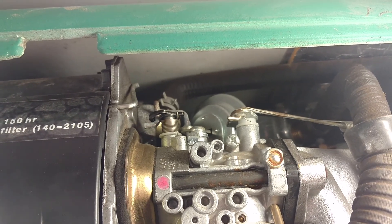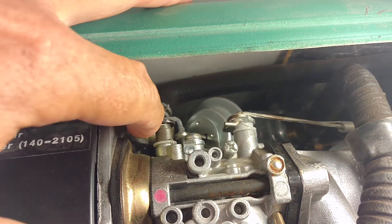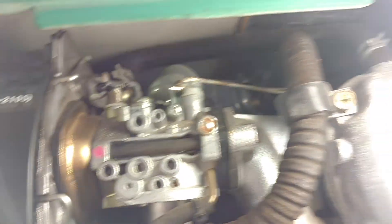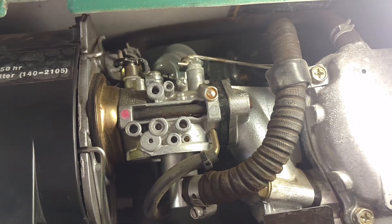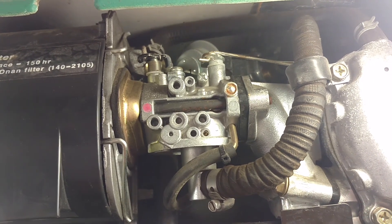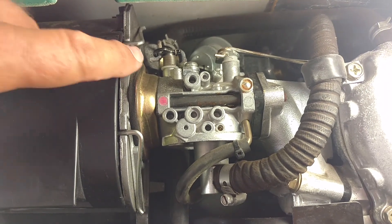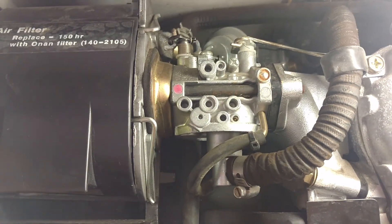What I'm going to show you here is the startup. You'll see it very quickly pull back open. And then after about 30 seconds, you'll hear a pretty tremendous change in the sound as the transfer switch switches the trailer over to generator power, and the generator picks up the load and starts working. And then after that, I'm going to shut it down and you can watch the choke very slowly close back to the position it's in now.